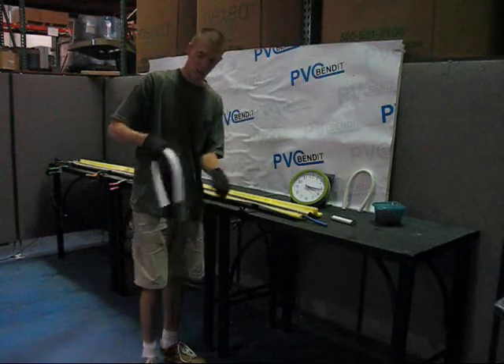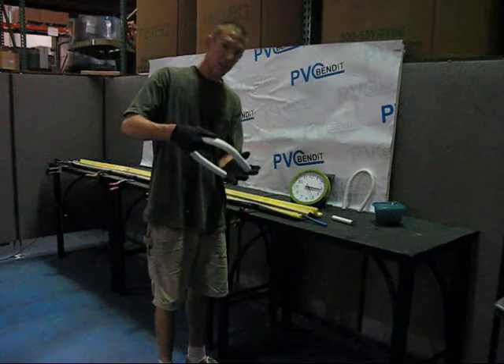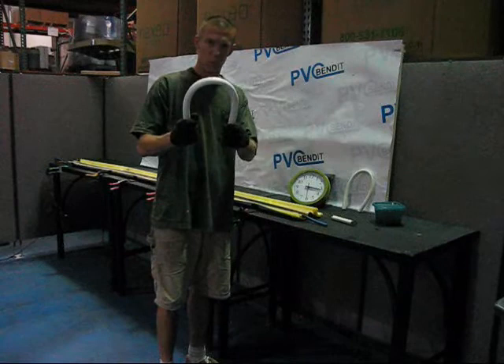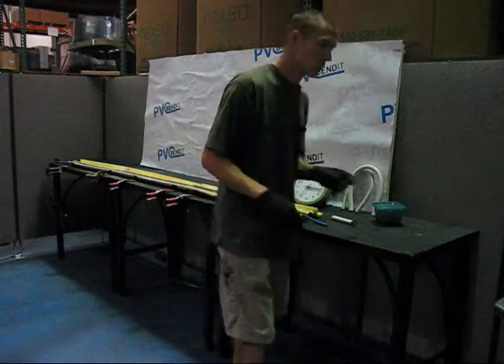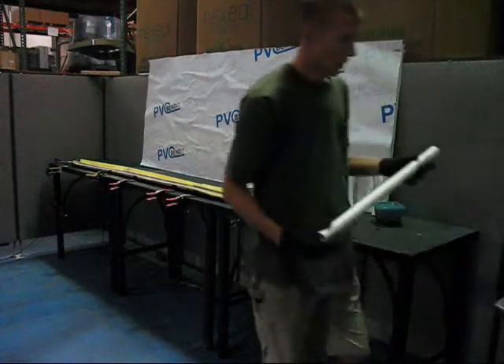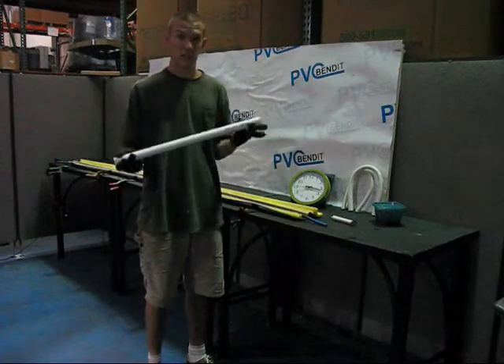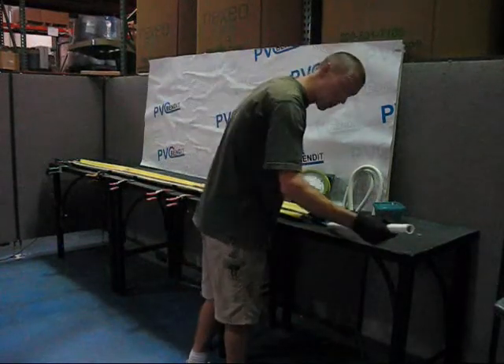That's very useful. If you're making a walker or something, you've got it. Making the top of canes, things like that — even three-quarter inch pipe can be bent tight enough that it's not ridiculous. Let's move on to one inch. When we get here, I'm going to move into the world of internal support a little bit, because larger pipes collapse easier. You'll be able to see one method we use to keep really tight bends from collapsing.